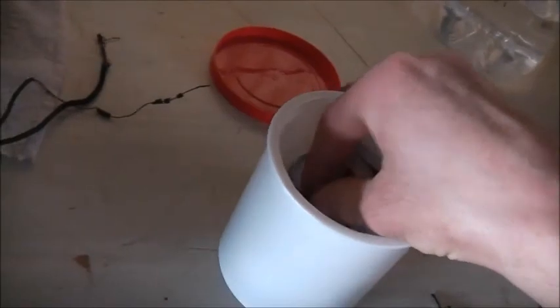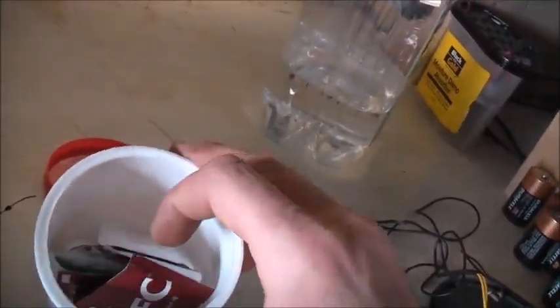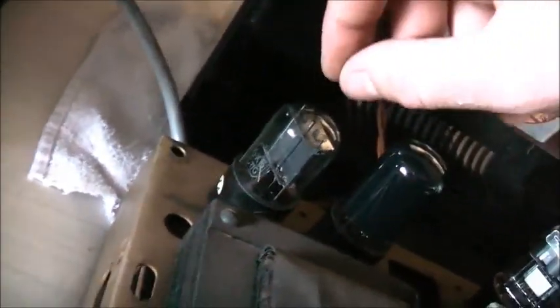But miniature valves, they will take the markings off miniature valves, especially Phillips mini watts. Takes the white marking right off. But for these older ones, it's perfect. It just cuts through all that baked on grease. Methylated spirits just wouldn't do it. The vinegar required way too much scrubbing, and that would have risked scratching the markings off. So this is the best way to go.